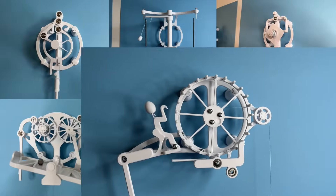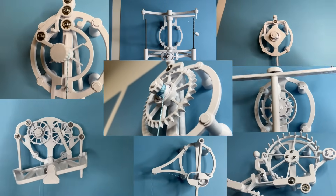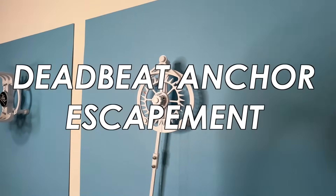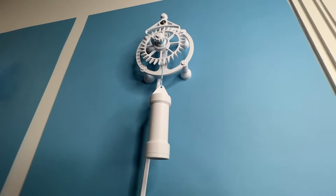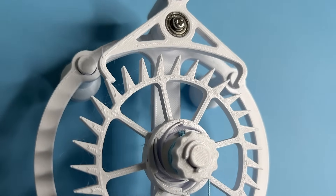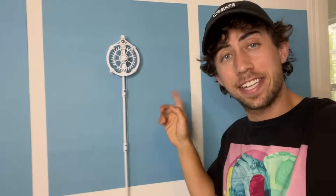If you want to 3D print any of these escapement designs, they're all available on jbvcreative.com — links are in the description below. The escapement I chose for this clock is the deadbeat anchor escapement, which has similar functionality to the recoil anchor escapement, except the anchor's design ensures there is no recoil on each beat. This makes the escapement more accurate, more reliable, and easy to 3D print — key for the constraints I've chosen for this clock's design.